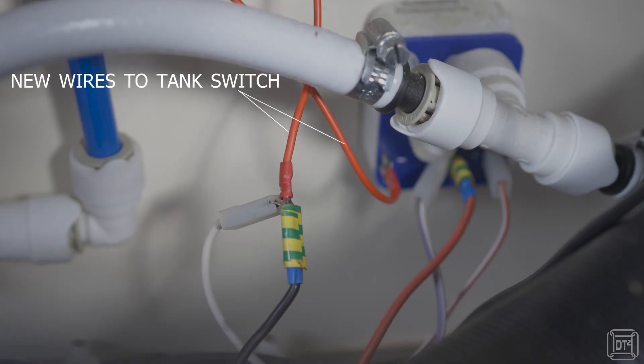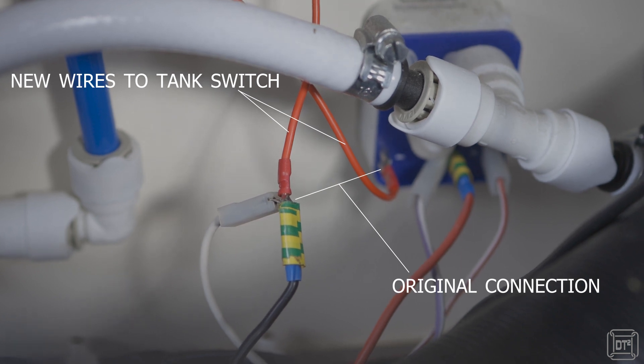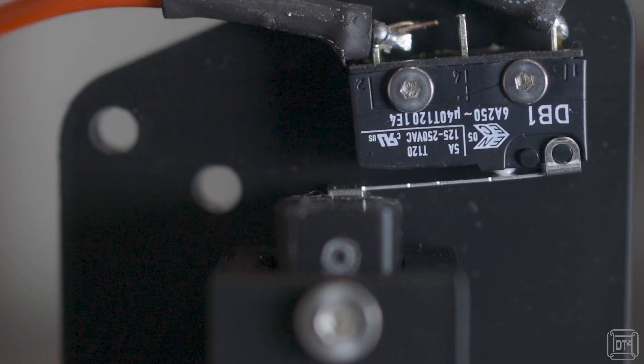In terms of wiring, all I had to do was splice it into the return feed to the pump, so we're switching off on the neutral — not exactly ideal, but it will work fine. I actually found it quite difficult to find a switch rated at 6 amps or higher for 12 volts. It seemed from the specs that the general rating of switches decreased as the voltage decreased — I'm aware that happens with AC, but this was with DC. I'm not entirely sure why that was; if anyone knows, please mention it in the comments. Either way, the switch I found is rated to 6 amps at 12 volts, which is more than the pump draws, so that's totally fine.